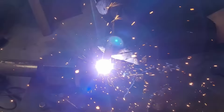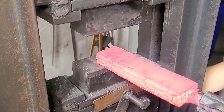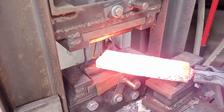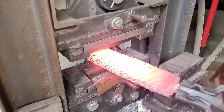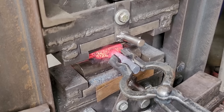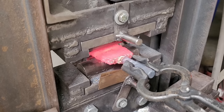I don't show it here, but I like to weld all the way around the billet as airtight as my welds can manage to ensure no molten copper leaks out. If I'm lucky and I keep it below about 1900 degrees Fahrenheit I should be okay, but it's good insurance, especially when I'm eyeballing the temperatures in my forge. When working with copper I found that slow and steady is the best method, because if you overpress it you run the risk of shearing all the pieces apart. So I take small easy squeezes and I slowly work it out as long and as thin as I can get the stock.